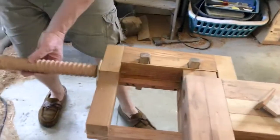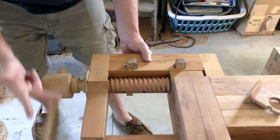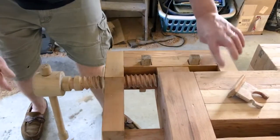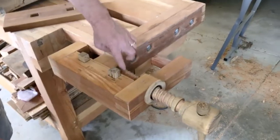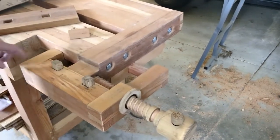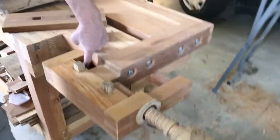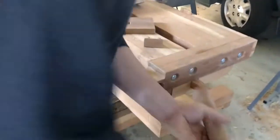Let's get the screw in there — see it slides in. The Douglas Fir is not nearly as hard as the eucalyptus, and if you look carefully you can see the screw has actually pushed into the Doug Fir just a bit. So what I did is I put a dowel in here and drove a little hole in the middle of the screw — it's more of an alignment thing. The screw goes right over that dowel and keeps it all lined up.